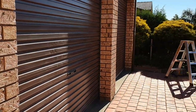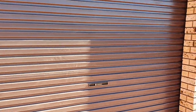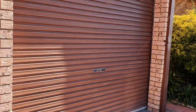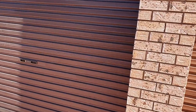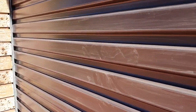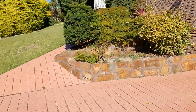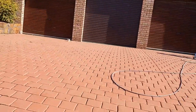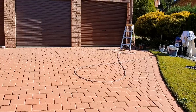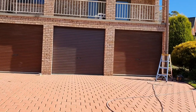For the primer we're using Dulux Maximum Strength Adhesion Primer — Dulux Precision. As you can see they're well scuffed up. We really need a good dust down. I'm not going to blow them down because you're only blowing a bit of wind on it — it's good for a bit of surface dust. You really need to get the bristles onto the duster and give it a good dust out like that instead.